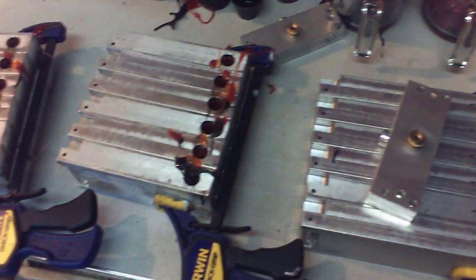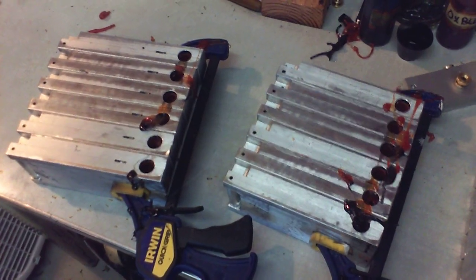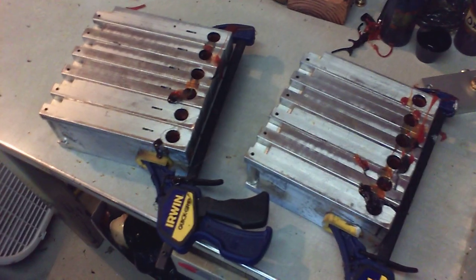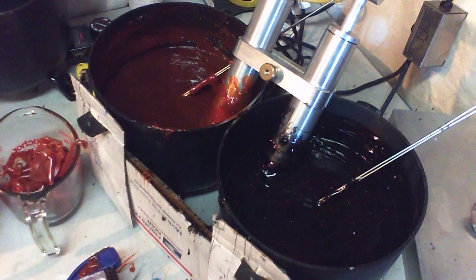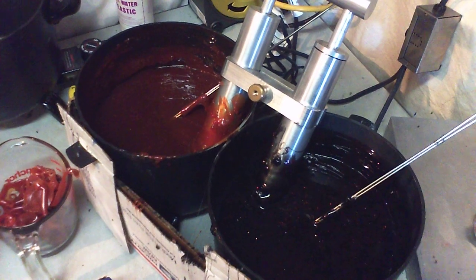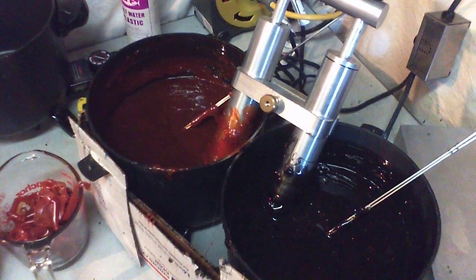I've got six there, six that are already done. These ones over here are actually cooling right now. So what I do is I shoot six, I slide them down, I demold, and then I bring those back to the front and refill with the twinjector. Then keep on going through that sequence until I run out of plastic.